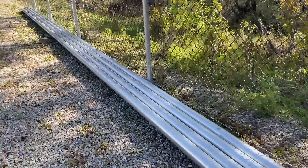Cutting aluminum tubing is easy with an aluminum blade and a miter saw. The splice is made using an internal coupler made from a two-foot piece of the same 4-inch tubing. The two-foot length of tubing is slit lengthwise in a jig that I built, using my power saw with an aluminum blade. A second cut removes about an inch of material, which allows the coupler to be compressed with worm clamps to be inserted into each piece. Since this type of tubing is roll-formed instead of drawn or extruded, it needs to be flattened out a bit to fit properly. The tubing is inserted into each piece as the worm clamps are removed and tapped in place with a hammer.